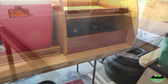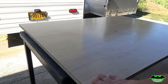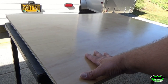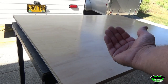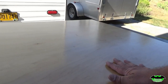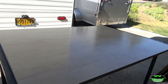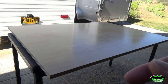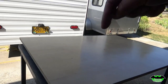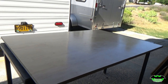Alright, let's get on with the countertop. Currently we have our countertop sitting upside down. I wanted to make sure that I varnished everything on the bottom side before we installed it, because it's pretty hard to varnish while it's upside down. I've got this nice and varnished now — it's nice and smooth. Next is to pre-drill our holes on the side of the trailer. We'll set this in place, get it fastened through the side, attach it to our bulkhead, and the countertop will be done.